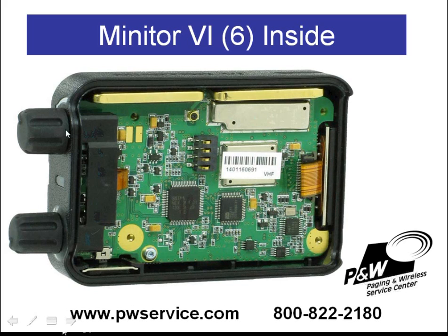The switches are not actually attached to the circuit board itself. The switches are held in place by this plastic piece. There is a ribbon here that connects the switches to the circuit board. So if you wanted to remove the circuit board, you would detach this ribbon and this ribbon. You would remove this knob and this knob. Underneath these knobs are nuts, and you'll have to remove a nut underneath both of these knobs, and then this plastic piece comes out.